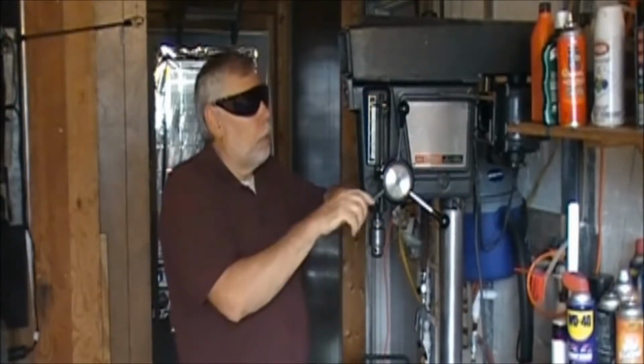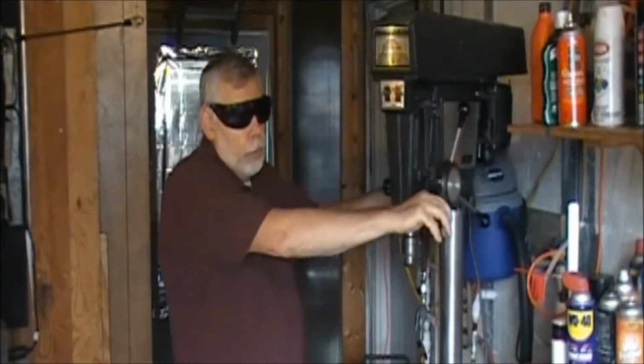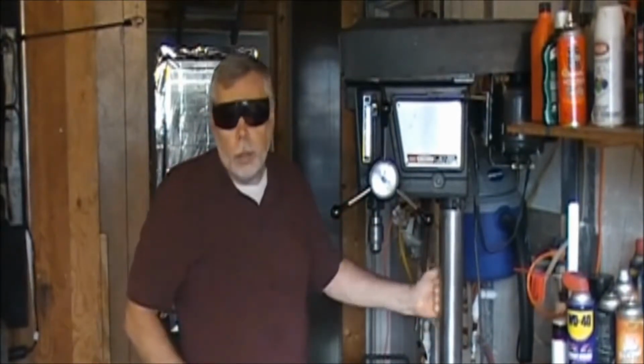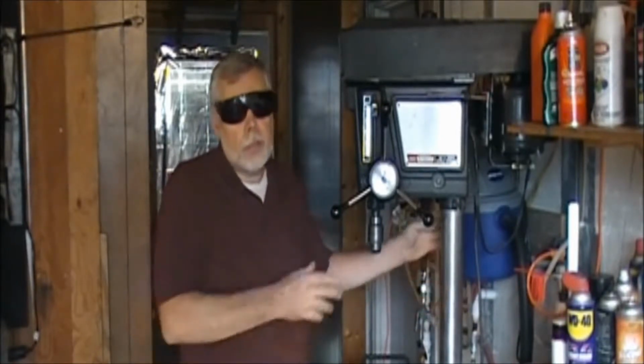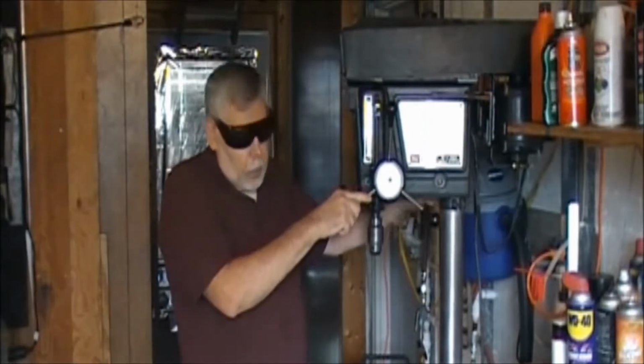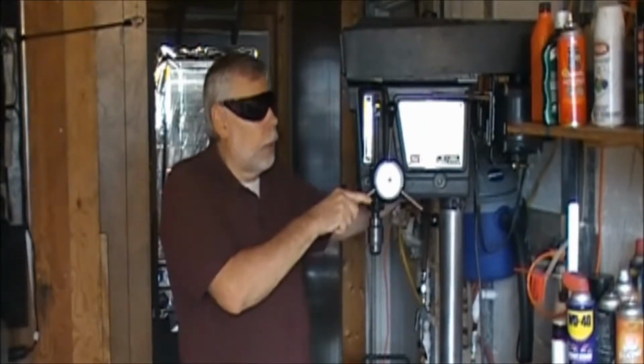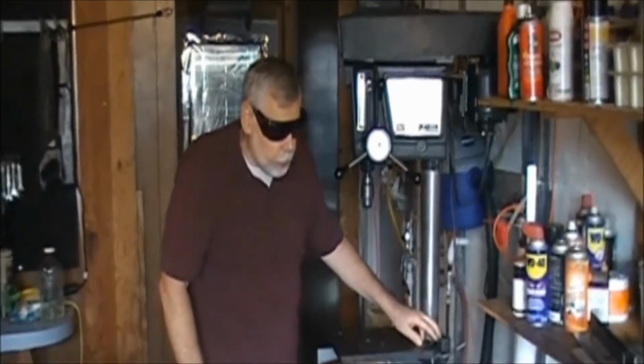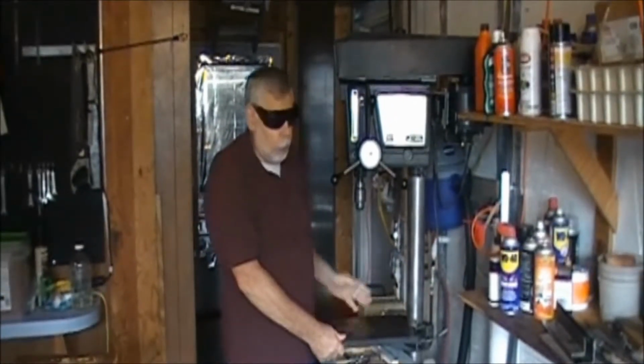The machine also comes with a lock so the head swivels in either direction, and it is adjustable on the 6-foot column. And this column is a real sturdy column. It's more than just a piece of tubular steel. It's probably 1/4 inch thick or 5/16 thick sidewall, cast iron base that's bolted to the floor. And so you can lock it where you want it. This also swivels so that you can swivel this table back and forth.